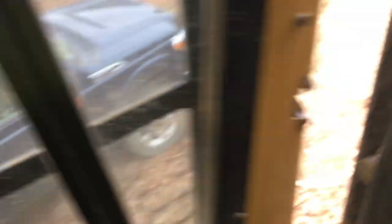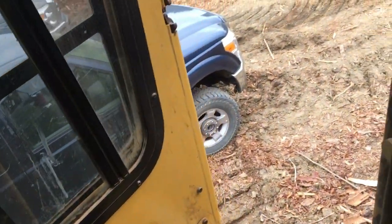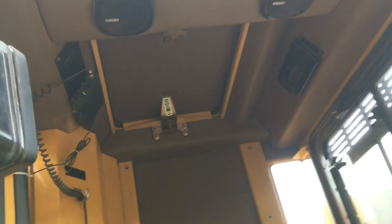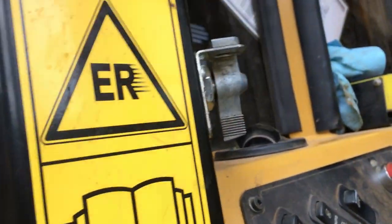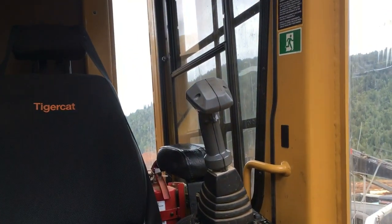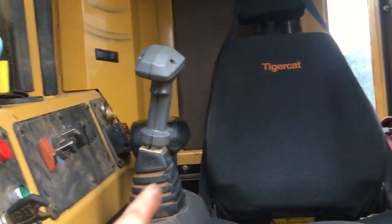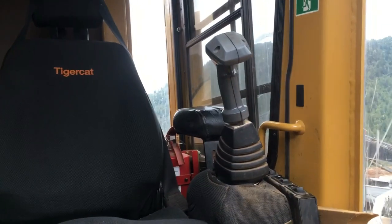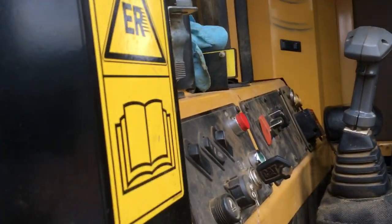It's got another door here you can kick open. You can see my crummy there — I still haven't come up with a name for that. There's a cab over and it's got the emergency hatch in case you go down. There's the night switch and this ER mode — shut that off. What ER mode does is, instead of pulling separately, you pull up on the jib boom and it brings the main boom back too. And it's super fast. I'm not used to it at all, so I just shut that switch off. It's freaking nuts — way, way fast. Faster than you can shake a stick.